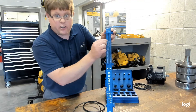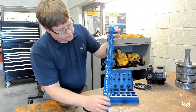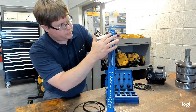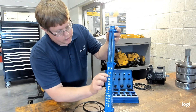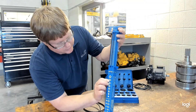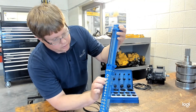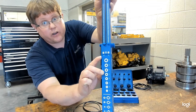Slide this open until the O-ring is straight on the sides. Especially with thinner diameter O-rings, you do not want to stretch them — you just want to move it until it's straight. Then look in the appropriate window, which in our case is going to be the one showing two halves, because that's what we're on. We're not on the half and a whole peg. So if you look in this window, you can see that this O-ring, when it is pulled straight, measures as a 158.